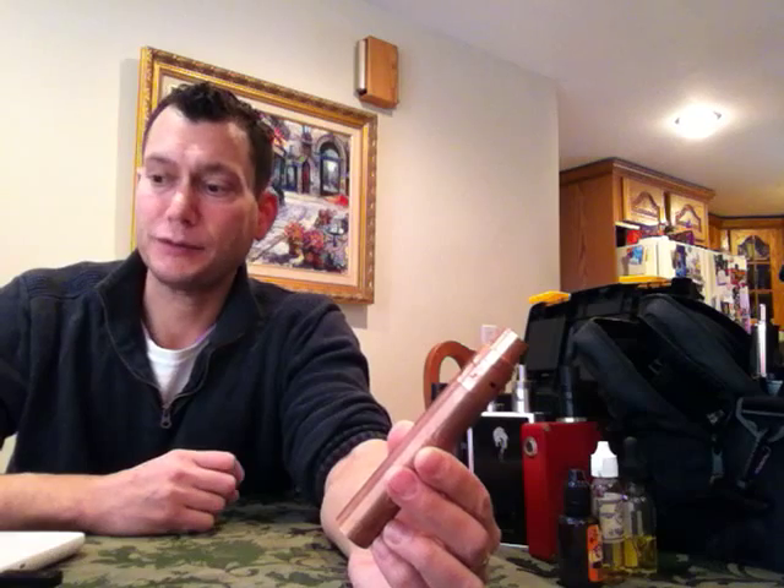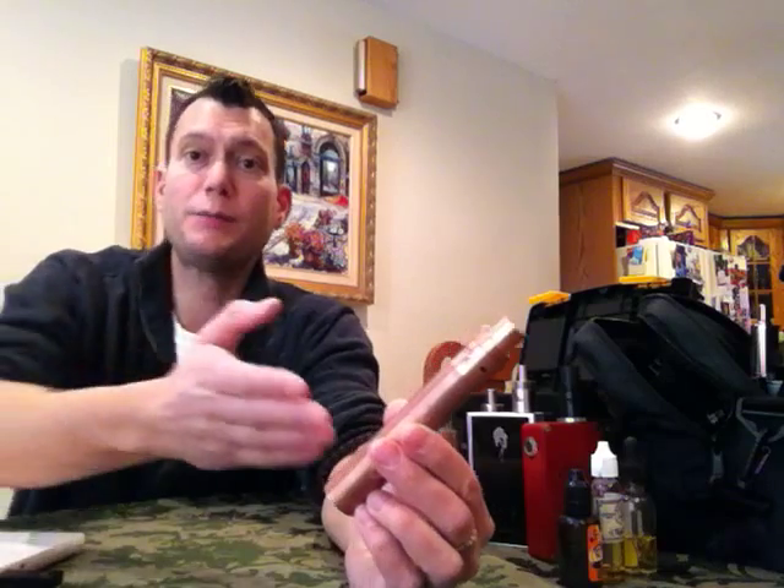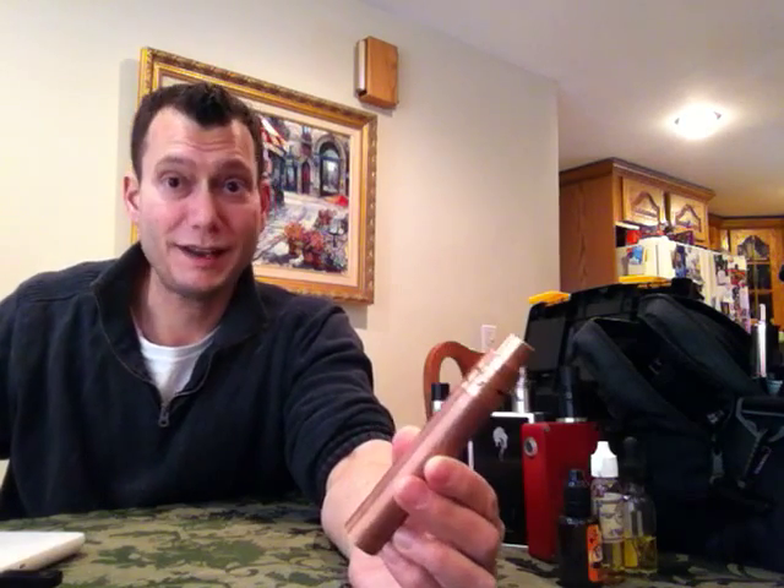That's why you have to look at other things about a battery, like discharge rate. This is an E-Fest 18650, 2500 milliamp hours — that just tells me how much charge I have in there. The discharge rate says amp limit 35 amps. But no battery can truly predict — they can put it on there, but it doesn't guarantee the battery's going to function that way every time. Over battery life, as this thing gets used and recharged over many cycles, its properties will change. They can put what's predictable on there, but they cannot say what's going to happen one hit to the next.